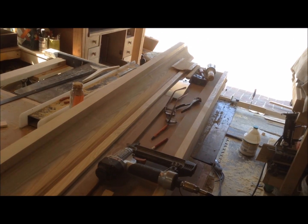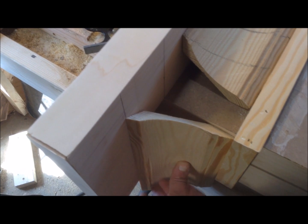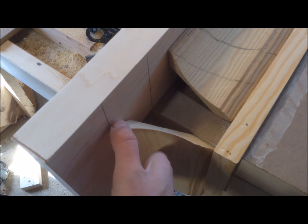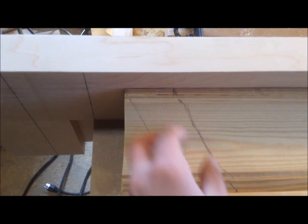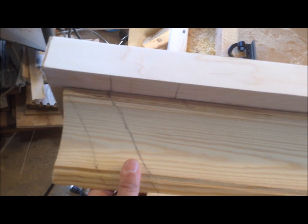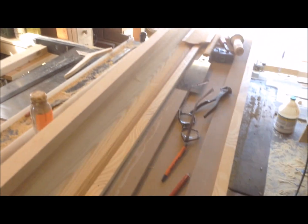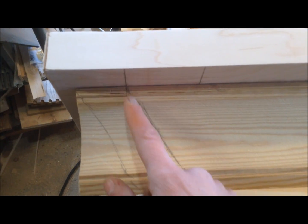So with those cuts, I have that side pretty much squared away. On this side, I made another little small piece and cut that compound miter on it and put it into place. And you could see those marks I made where they intersect is where the intersection of this crown should be as well. So then I took this piece and I slid it all the way over to that intersection, as well as lined it up over there on the other side with the intersection and drew a left reference line. Now I'm going to sneak up on this line.